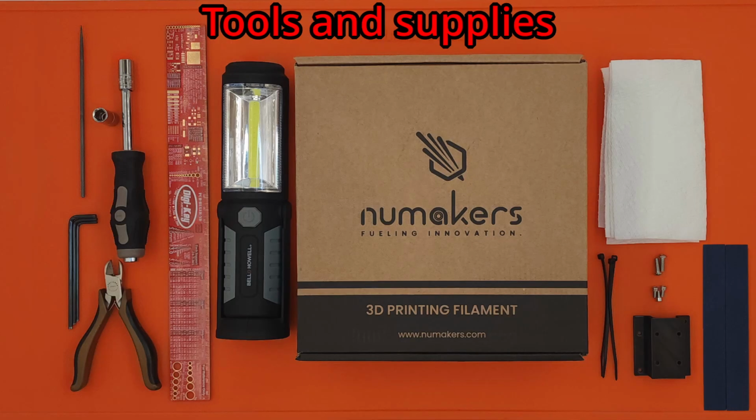A handful of tools and supplies will be needed while installing the mod, including two 2.5 and 3 millimeter hex wrenches for tightening and loosening screws, and a pair of side cutters for cutting and trimming zip ties. A 7 millimeter socket is also required, and if you have the front diagonal brace mod already installed in your printer, an 8 millimeter socket.